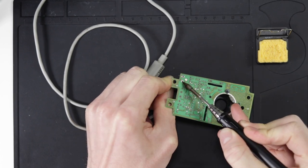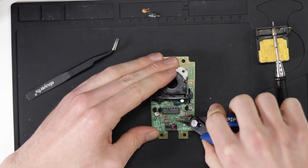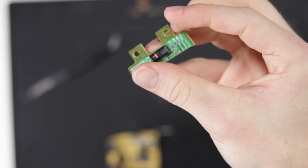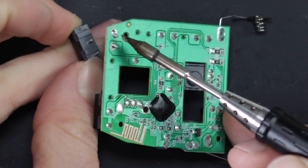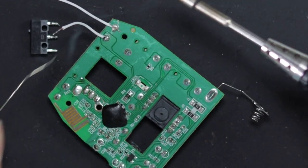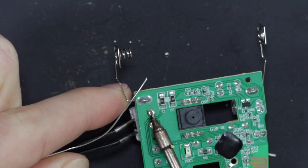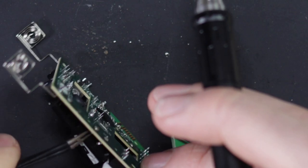Now we shall focus on the board. I'm going to use the original switch and the top of the PCB, which will align everything and ensure that it is in the correct place. I removed all of the components besides the button and then cut and sanded the PCB. I then removed the old left click button and stripped and tinned some wires, then joined the PCBs together. Next up, I removed all of the other switches as we're not going to need those, and removed the battery contacts and extended those with some wires.